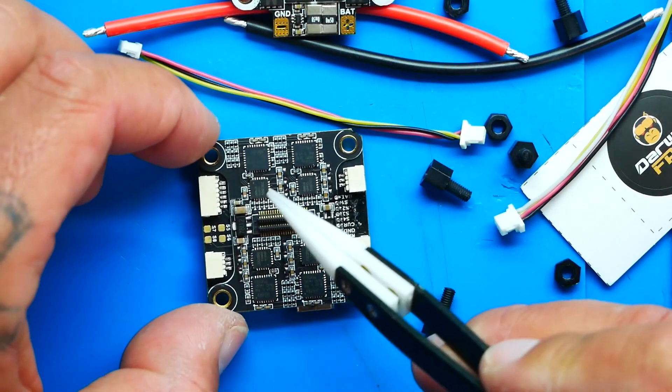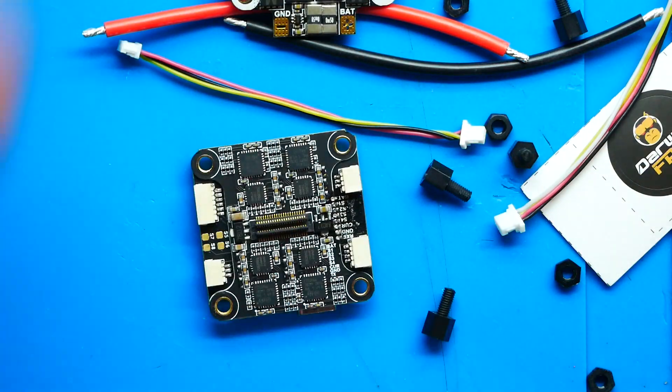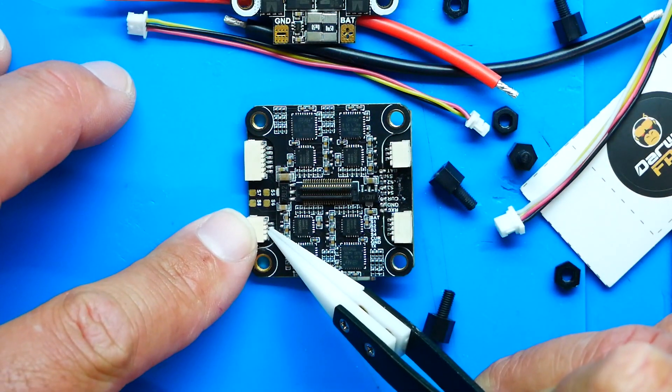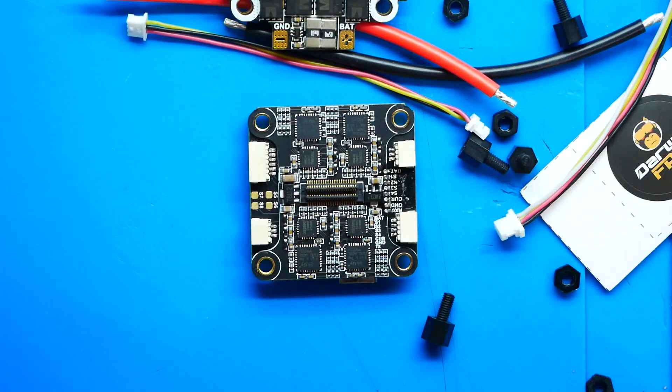Here are your four different connectors. The beauty is the DJI connector, but even if you're not running DJI, this board is truly DJI capable because it has an onboard 10-volt BEC — battery eliminating circuit. You can plug and play your DJI unit, your RXSR or Crossfire Nano, your camera, and your VTX — no crazy soldering required if you prefer to set up with connectors.